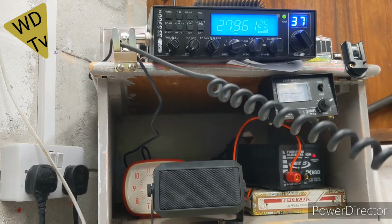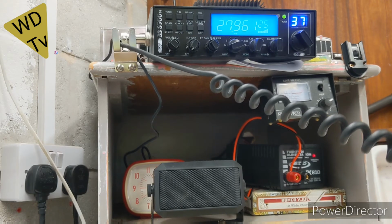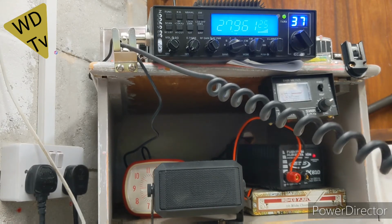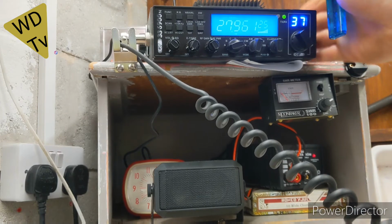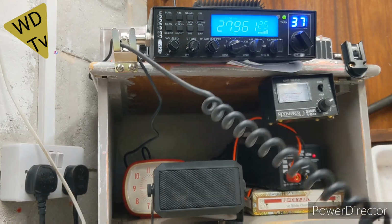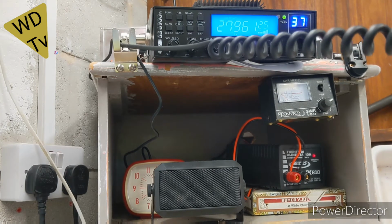Yeah. And it's awkward for me to try and explain over the air to Bruce to try different things, you know. So Terry went and had a look at the plug and completely re-soldered it, put it all back together, and it was still humming. It had no effect on it whatsoever. But yet, Bruce could put his hand on the radio, the hum goes away. So he's actually giving it a physical earth by touching the radio, and the hum stops. So we're all thinking it's definitely an earth issue. So we tried putting jumpers across to earth the chassis of the rig to an earthing point in the shack, or earth it against another radio or whatever. Still didn't cure it.